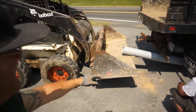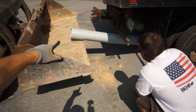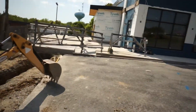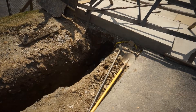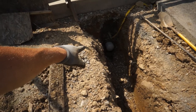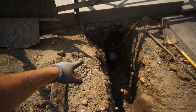We used the Bobcat and you can see we've got a definite pitch on it now — about 22 degrees. We've got a 22 there and the other 22 is underneath the truck. What we're trying to do, instead of just putting a 45, it would have just came out too much. Those bends are probably 17s or something. But you can see we've got a six-inch pipe there — it's buried up into the bottom part of the restaurant.